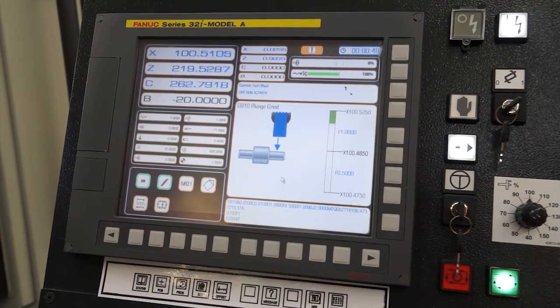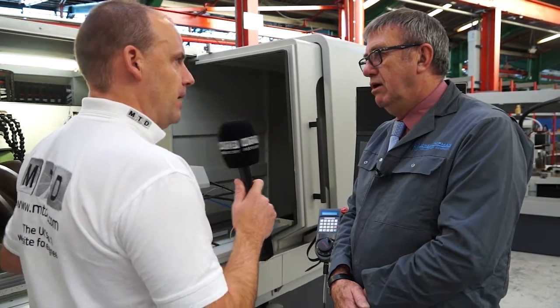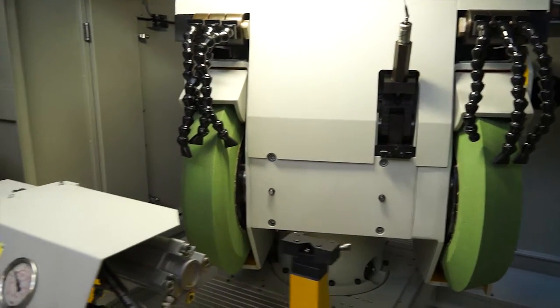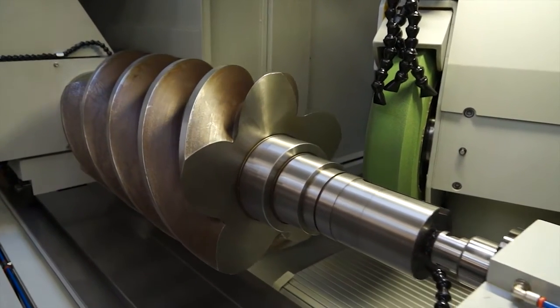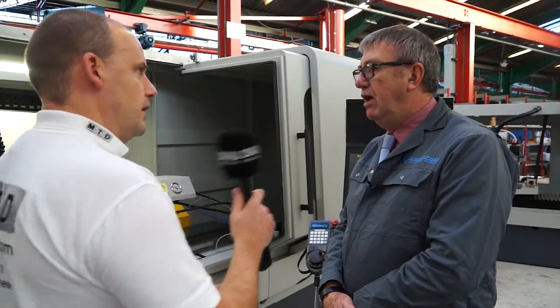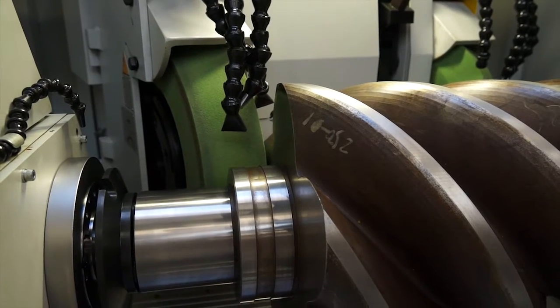So we could program another part if we wished. Now, what about how this machine is put together? It's done here in Leicester — but what goes into the build of it to give you the accuracies spoken about? Well, it's the whole construction, the type of casting that we use, the material — they're very high quality castings. The bed is the full length of the table, so the table is always supported at all times. Some machines may have some overhang, but this one's fully supported. And is it scraped? It's hand scraped Turcite ways, hand scraped by our fitters here in Leicester. And do you have scales on this machine? Yes, definitely — scales on the Z axis, on the X axis, there's encoders on the B axis and on the C axis.